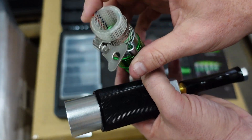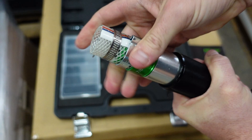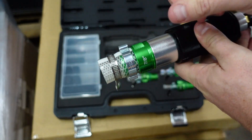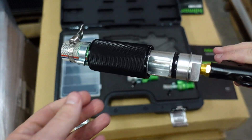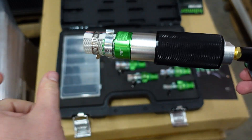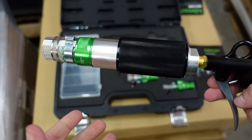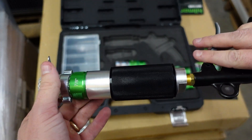One thing you definitely want to do before you attach this to your tubing is make sure you ream the end first, because otherwise when the pigs or plugs go through, it can damage the edges on them. Another extra move you can use with line sets that are really dirty is to put just a little bit of Pro Flush — or a whole can, however much you want — down the line first, and then follow it with the plugs. If you do that, just make sure that you catch it on the other end so that stuff doesn't go flying out, because you need to account for and catch it.